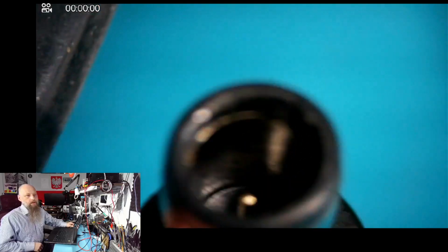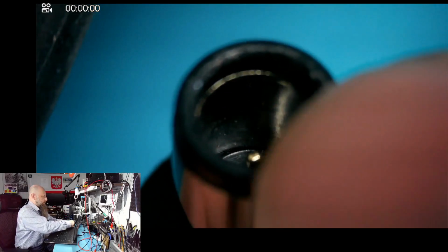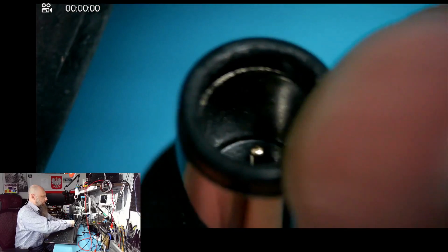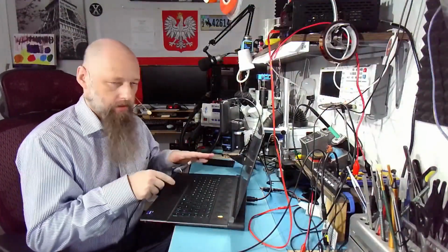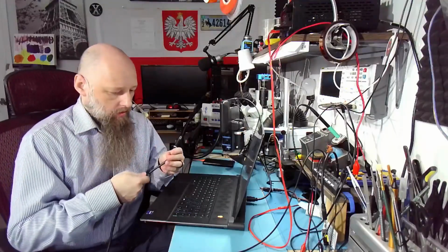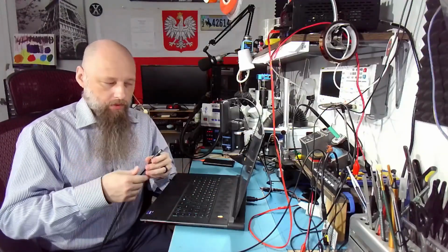This is our adapter plug, right? So we see the little pin inside, and the positive is actually the inside of this tube. The outside is negative, and that little pin, that's called ID pin. That ID pin actually communicates with the SAM chip, identifying the charger.